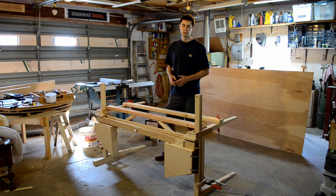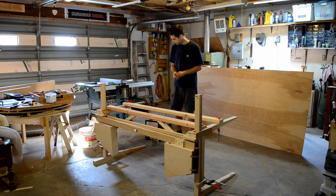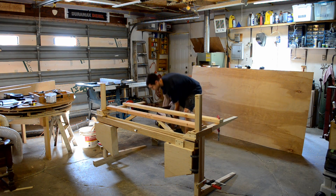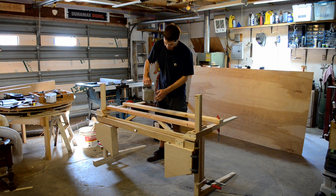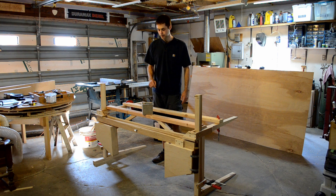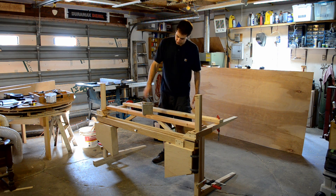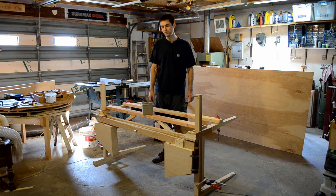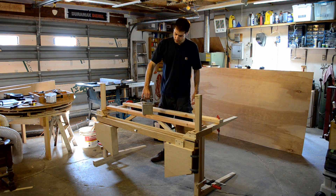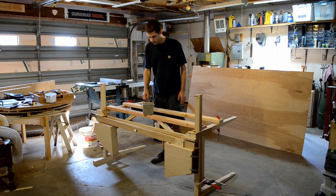I've been trying to think what is the best cheap source of steel we can get, and what I settled on is nails — you can buy nails for about 70 or 80 cents a pound. We bought a 50-pound case of regular 3-1/4" framing nails. We did a test on an old screw container: filled with just play sand it came out to about 5.5 pounds. If we add nails, straighten them out without a ton of effort, and filter sand in over top, we maxed out our little scale at 13 pounds — that's more than double the density. So we'll be able to use a thinner profile on the counterweight, which solves our width problem.